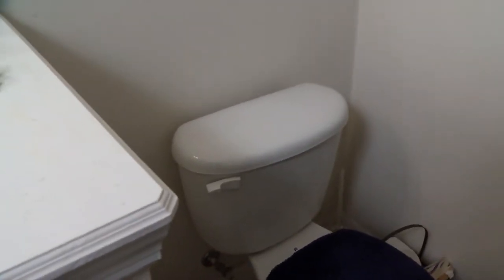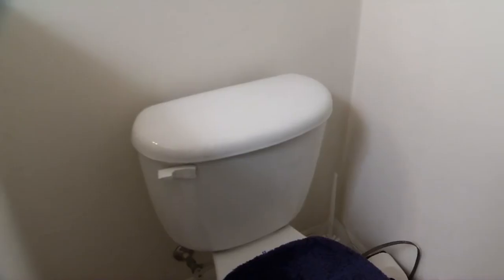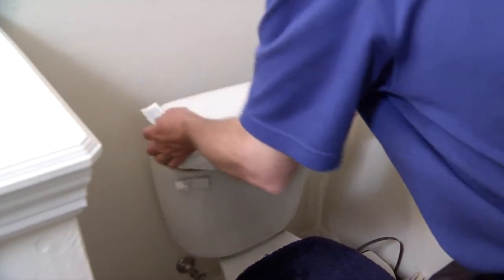What we have is a tank that fills full of water, and when you flush, often that tank has a flapper valve in the bottom that gets old and starts to leak. What we can do is find that leak by using a little blue pill. We're going to take the blue pill and put it in our tank.